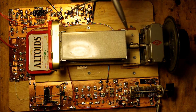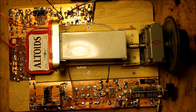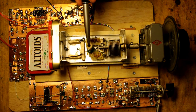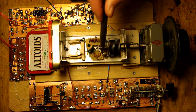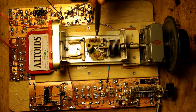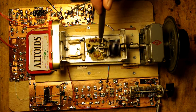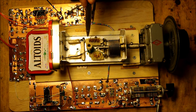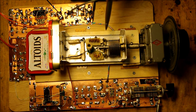This box contains the frequency-determining elements — the coil and the main tuning cap. Pop the hood: there's the cap, there's the coil, wound on a cardboard tube. You can see these caps associated with the main tuned circuit. I used multiple individual caps in parallel to spread the capacitance among capacitors, and that helps with stability because no individual cap heats up enough to really change the resonant frequency.